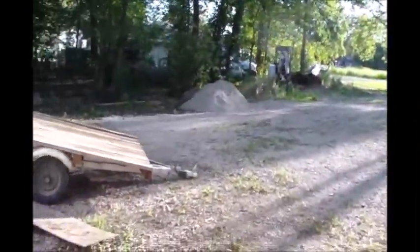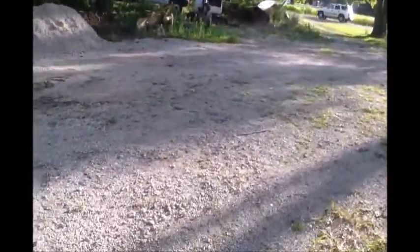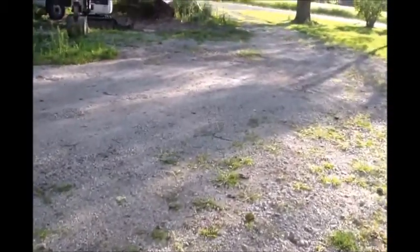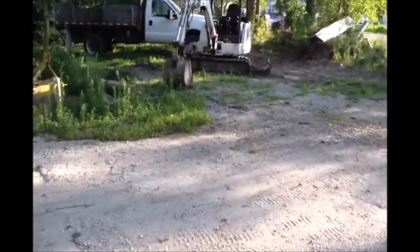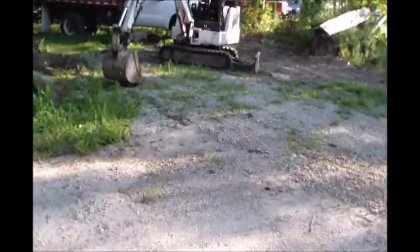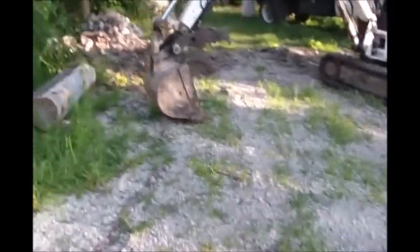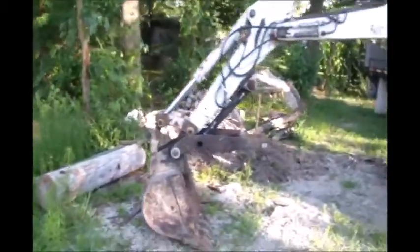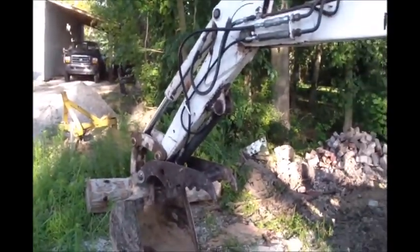When they're doing a job to pull in a long run of wire, like if you were going between cities, they would put dollies out on the poles and run this wire through the dollies, then attach it to the cable at the other end and drag this rope through those dollies and pull that wire through. They've got some real big pullers on the end, with huge drums of that kind of rope, and they can put out a lot of force. So it's a real high rated rope.